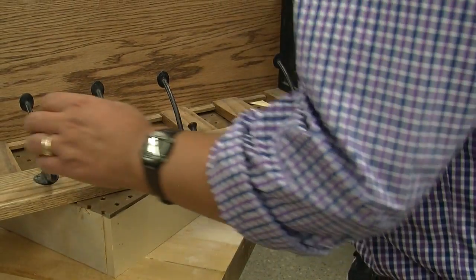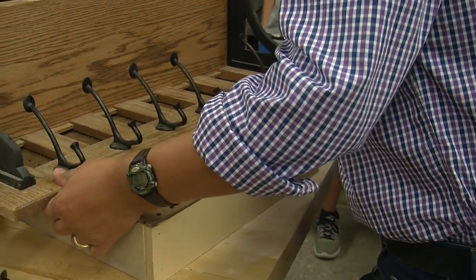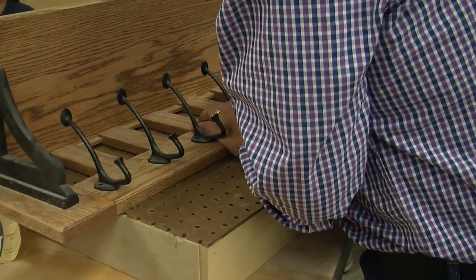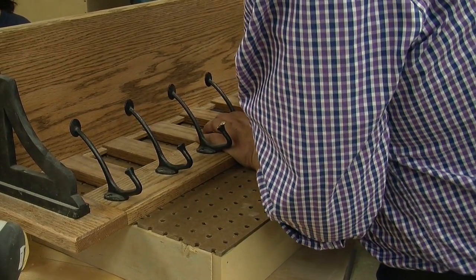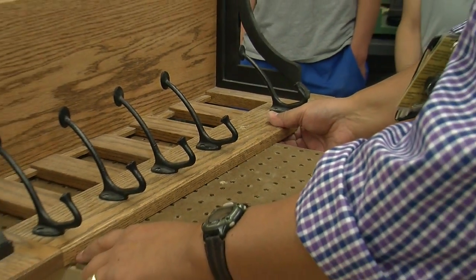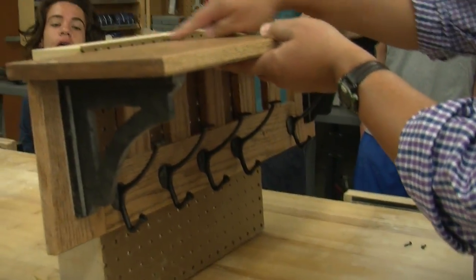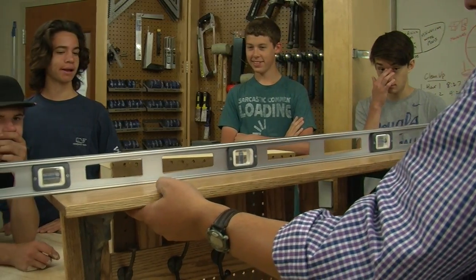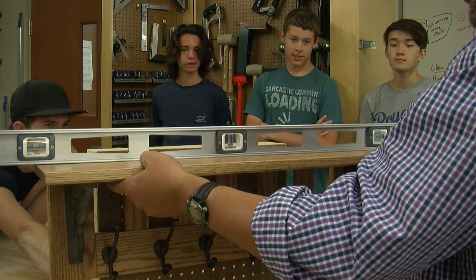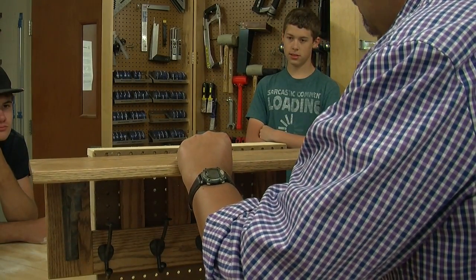Then go ahead and attach one of your screws to your studs. And this should be really tight now against your studs. Really tighten that up because you don't want that to go anywhere. Okay? For your other one, take a level before you screw the other one and level it out. Do you see how I'm not level here? Okay, recording? Yep. Take a level and make sure that you're, thank you, all the way level, and then screw your other screw in. You should have the other hole done. Okay? You need at least 2 screws to hold this up.